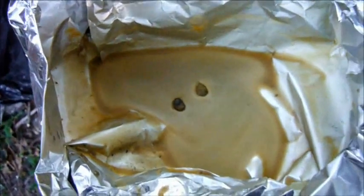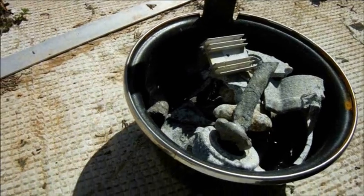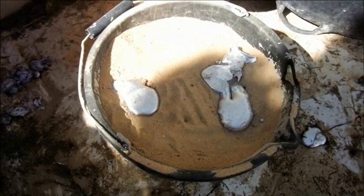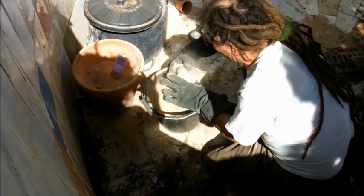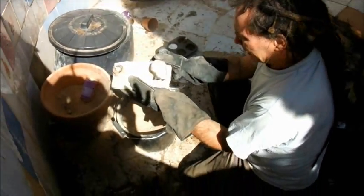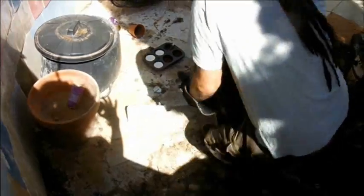If I'm not going to pour metal the same day, I cool the piece slowly by leaving it in the oven to cool down as the oven cools, and then reheat it equally slowly on the day of the pour.